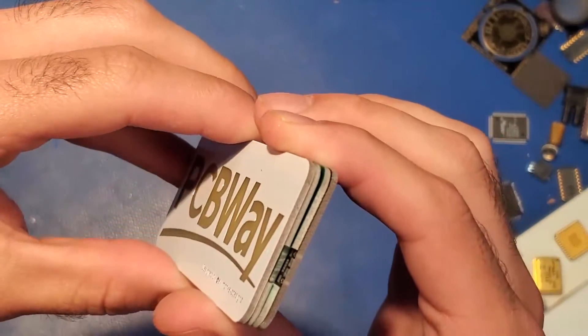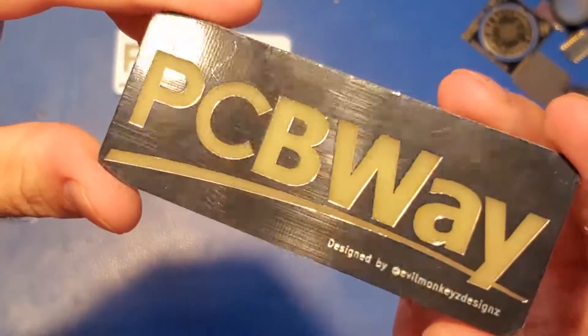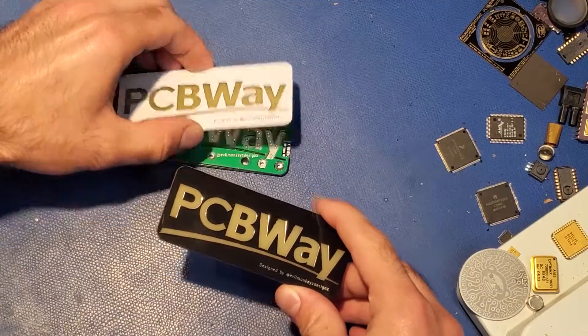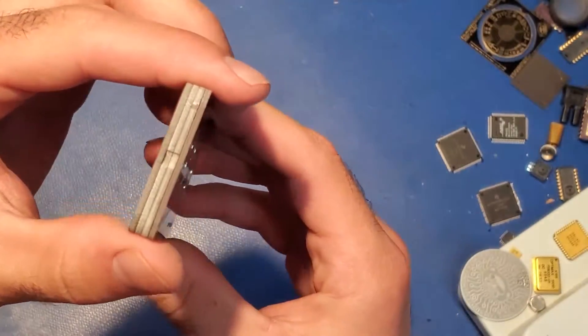The two soldered halves will be held together with neodymium magnets held in place with epoxy. I also got L4 made in black just to see if one looked better than the other — which do you think looks better? The dimensions of each board are 40 by 100 millimeters and they are the standard 1.6 millimeter thickness. They all turned out great.